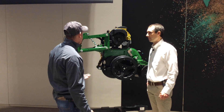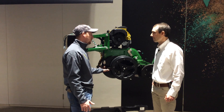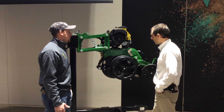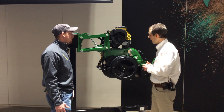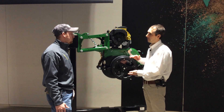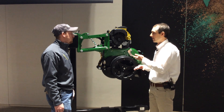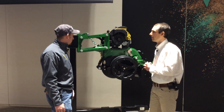Can we change the depth from an inch below the seed — is this adjustable? Yes, it is adjustable. In most cases we're recommending guys target about an inch, but it has a range from equal to the depth of the seed all the way up to right at the surface of the ground, so there is quite a bit of adjustability built into it.